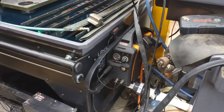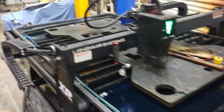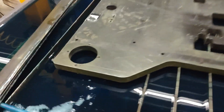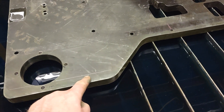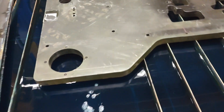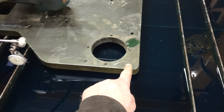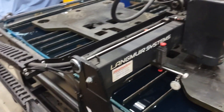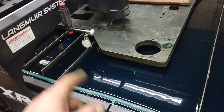Obviously we'll be cutting at 45 amps, no piercing — we'll start from an edge cut. All I really want to do is cut about an inch off this edge. See that scribed line right there, and over here. I wanted to get it pretty straight because I'm going to be using this as a fixturing slash welding table, so I threw my machinist indicator on there.